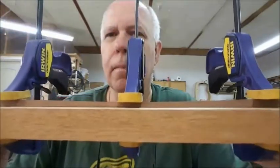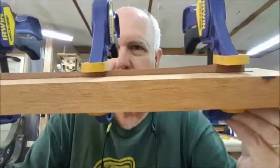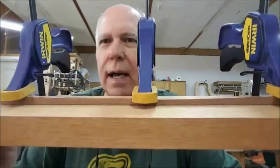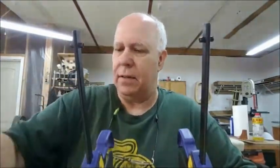I'm going to go ahead and finish the other side, and when I'm done I will show you on the filler strip exactly what's going on with that truss rod. I've finished gouging out the channel, installed my filler strip, and clamped it down. You can see how there's a gradual drop all the way across the truss rod from center to either end — approximately an eighth of an inch drop — and that's what's going to give us our action on the truss rod. I've drawn a line on this so you can get a better idea.